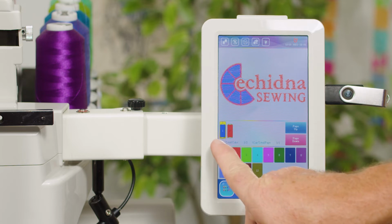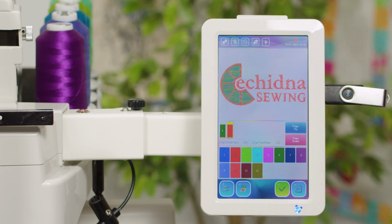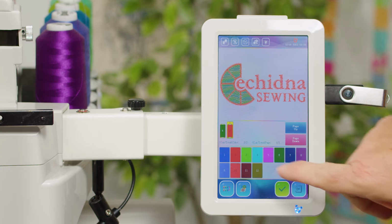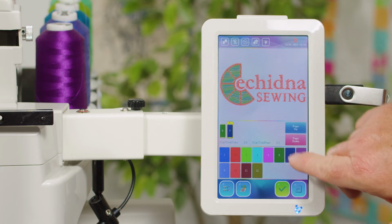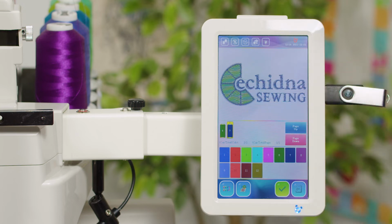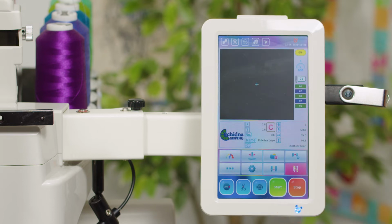So the first color is selected, which is color stop 1, and I want to use needle 6. Now it's showing green, but that's because I haven't set my palette on my machine. And this is something that, when you get into industrial machines, you rarely ever do. You just simply use your eyes and look at what colors you want on what needle, and that's what you're going to select. I do know that I've chosen needle 6 for my first color, and I want needle 7 for my second color. Again, it's irrelevant what colors show here. It's what's on the machine on those needles that is important. Once I've got the colors selected, we just click OK.